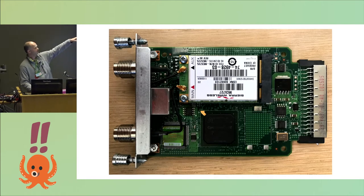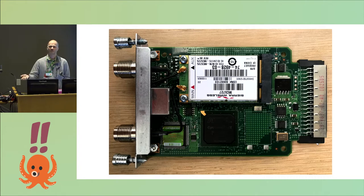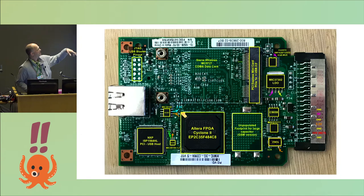If you look at the board, you have an off-the-shelf modem that fits in a PCMCIA slot, and the FPGA itself is used as glue logic to connect it to a HWIC slot. That slides into a standard Cisco router to expand it with a WAN connection. The component has the FPGA, a JTAG USB blaster pinout as a debug port, an RS-232 connector, some RAM, some unpopulated NOR Flash RAM, et cetera. It's really very useful for hobbyists, so I set out to completely reverse engineer it.